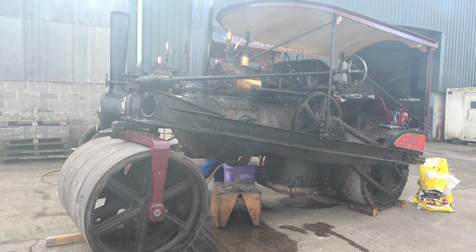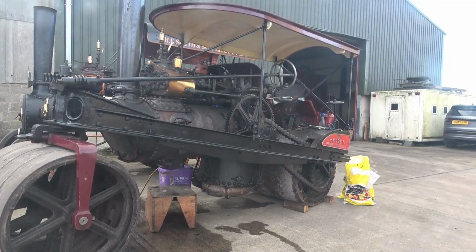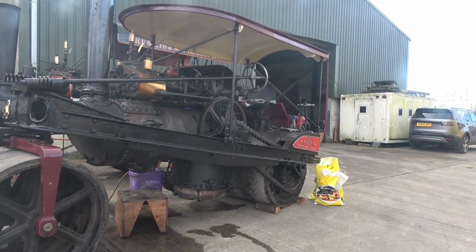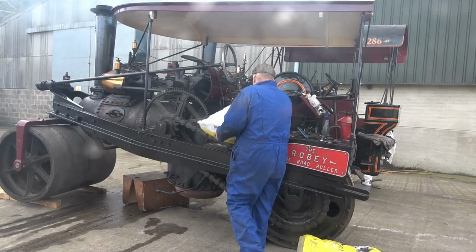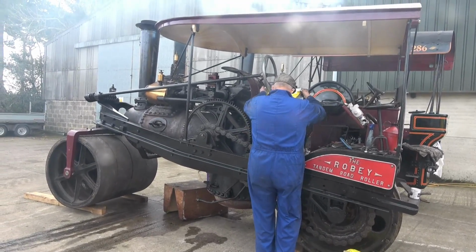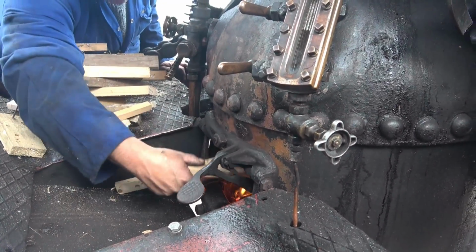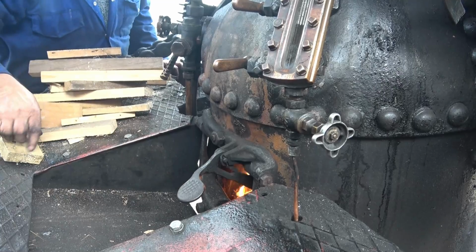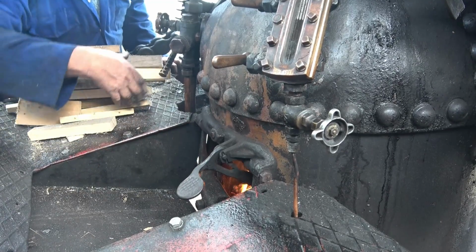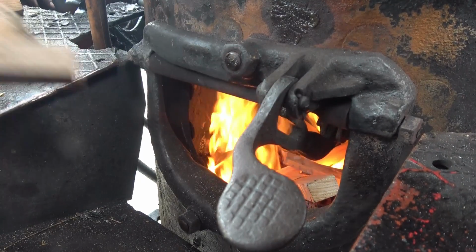This is a 1924 Roby tandem steamroller. You'll have seen plenty of video of this on my videos and on my channel. At the minute it's got all its lagging removed because it's just had its 10-yearly hydraulic boiler pressure test. Phil's getting ready to light a fire in here so we can do the steam test on it. Wood's used to light the fire, but we're going to use wood all the time because we don't want a really hot coal fire in there. We want a hot fire that we can take out quickly.